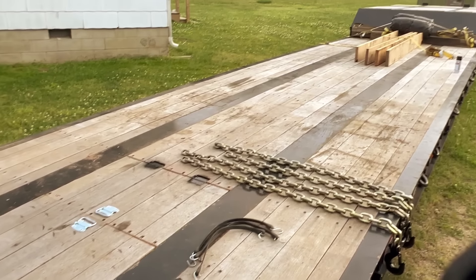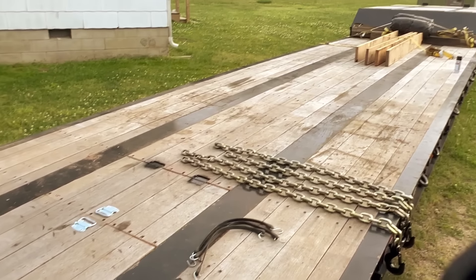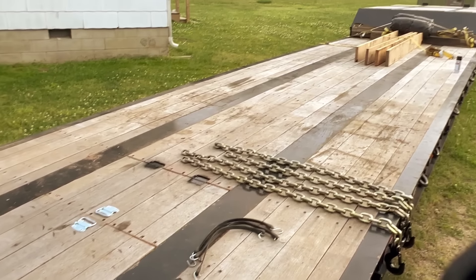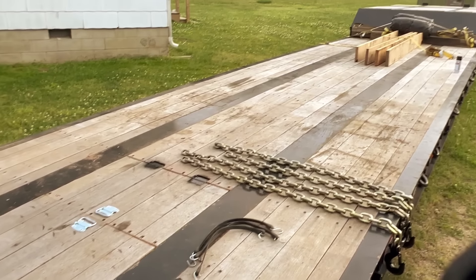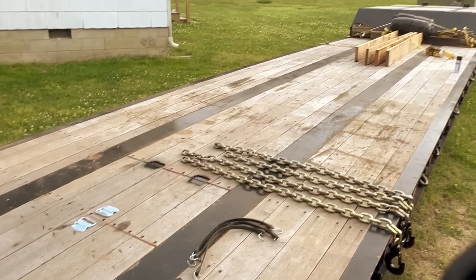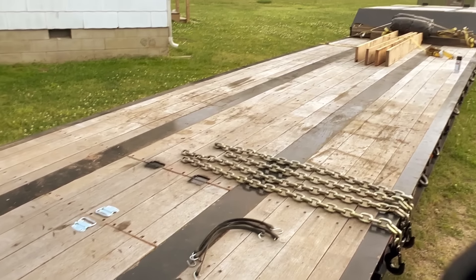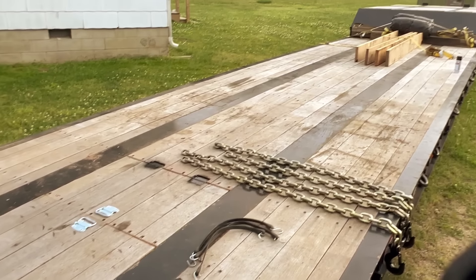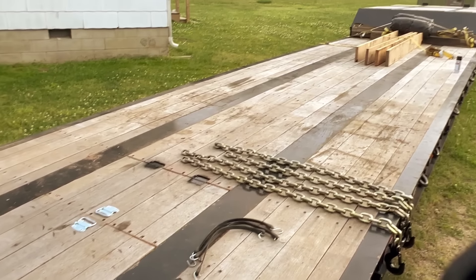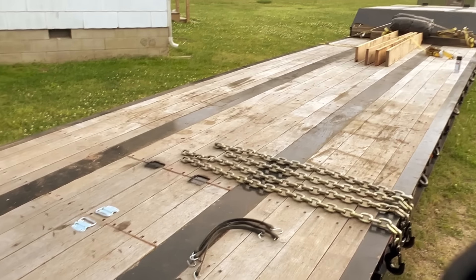So friends, I set up the welder at 240 volts. Cut off the old socket, went and bought a four-pin one here — I had the old style before, this is the new type now. So now I have three phases. Normal 170 amps — the weld penetration will be good. We're welding D-rings. Just tacked one now, looks normal. We'll be adding additional D-rings. The generator sags a bit — maybe 170 is a lot, but the weld penetration is good. I'll show everything later.